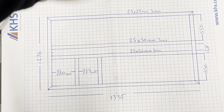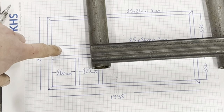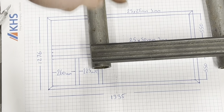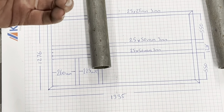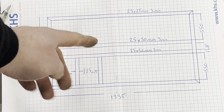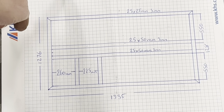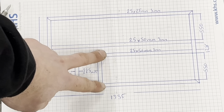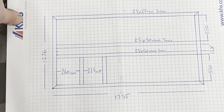You can run one of those over the top. And then you could put box section, 125 mil long, in there, if you wish, if you don't want the exhaust vent coming straight out the bottom. Completely up to you. It's open design to how you want to interpret it. You don't even need an exhaust tunnel. If you're going to run a single seater, your exhaust will run down here and out the side. So you could get away with ditching the one, extending these, and moving your seat further over. Do you know what I mean? It's pretty much however you want.